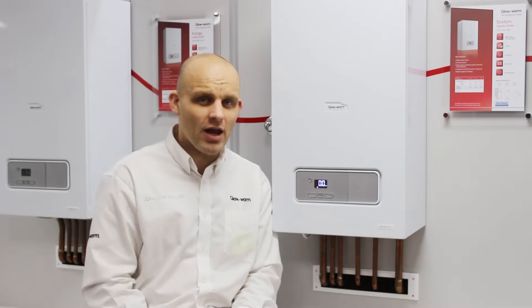When do you know when to re-pressurise your system? Perhaps it's flashing 00 or F22. Ideally your appliance should have one bar of pressure in the system — this is for the system to work most efficiently and durably.